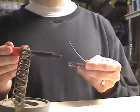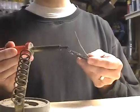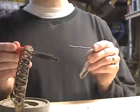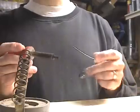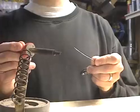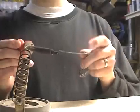To tin the soldering iron tip, you just melt solder directly onto the hot iron tip. But this is the only time you apply solder directly to the iron tip. You want fresh solder on the tip just before you actually solder. You need to make sure you clean the excess solder off the tip before adding new solder.